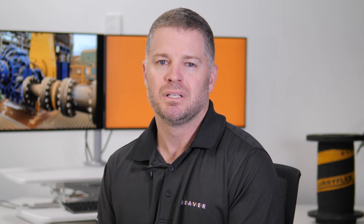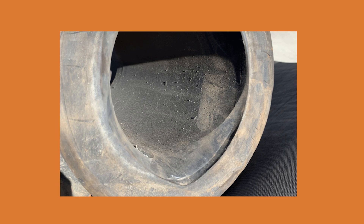Leading edge wear happens when the internal diameter, or ID, of a joint in pipework doesn't match. Even just a few millimetres of ID misalignment is enough to cause a problem. Slurry will catch the lip of the smaller ID and start wearing away at the joint, creating leaks and adding to slurry turbulence, which creates even more wear.